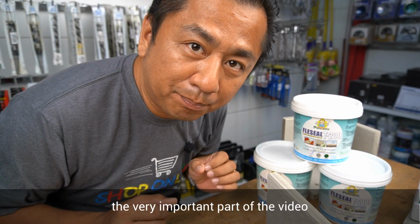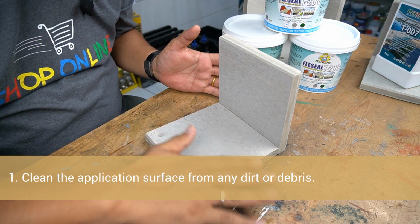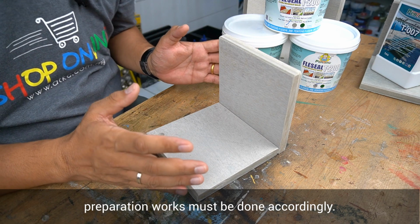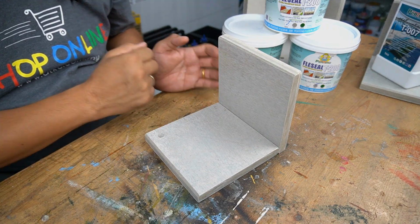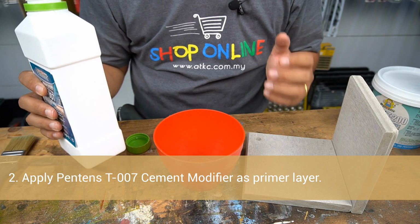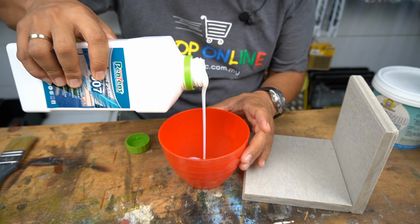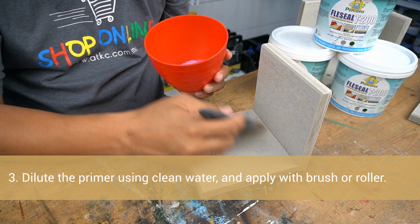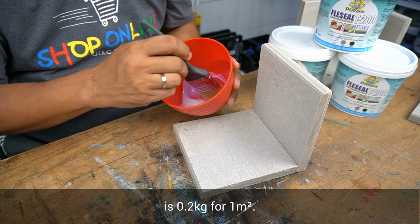Here comes the very important part of the video on how to apply Pentens FLESEAL T-200. Are you ready? To begin, clean the application surface from any dirt or debris. Please remember that preparation works must be done accordingly. For example, surface and crack lines repair, floor leveling, and anchor fillets. Next, I'm gonna apply Pentens T007 cement modifier as primer layer. You may dilute the primer using clean water and apply it using brush or roller. For your information, the coverage of this primer is 0.2 kg for 1 meter square.